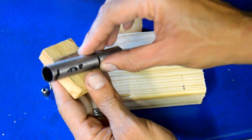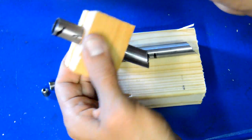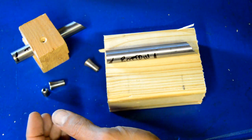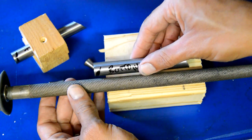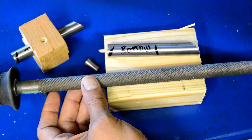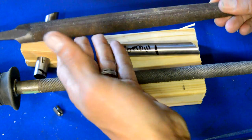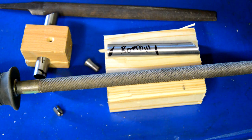For the seat stays I'm going to use this big round file — it's pretty close — just going to freehand it. I've marked where the angle needs to be cut and I'll file it from there, then probably use this half-moon shaped file on the bottom end between the chain stays. But yeah, that's where I'm at right now.